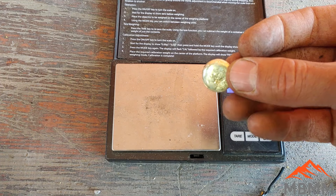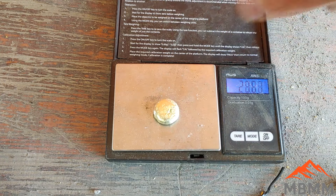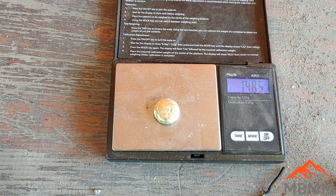Here's our bead, and I still can't get over how big it is. Let's put it on the scale — 14, almost 15 grams. Wow, that is amazing. I used the lead from the first two smelts — 100 grams twice, so 200 grams — and then 300 grams in the number 10 crucible. So this is the precious metals from about 500 grams of those concentrates. That's really amazing — that's almost 3% precious metals by weight.